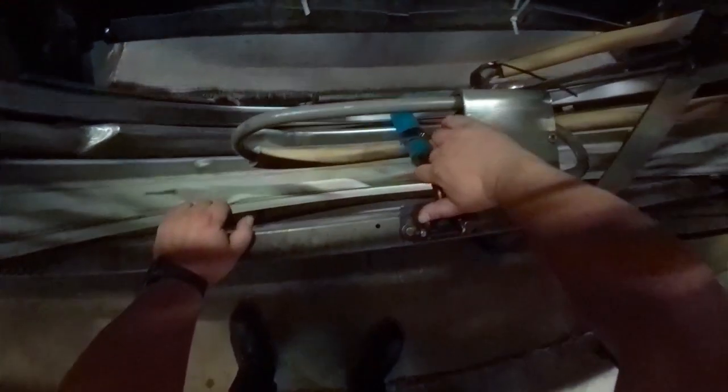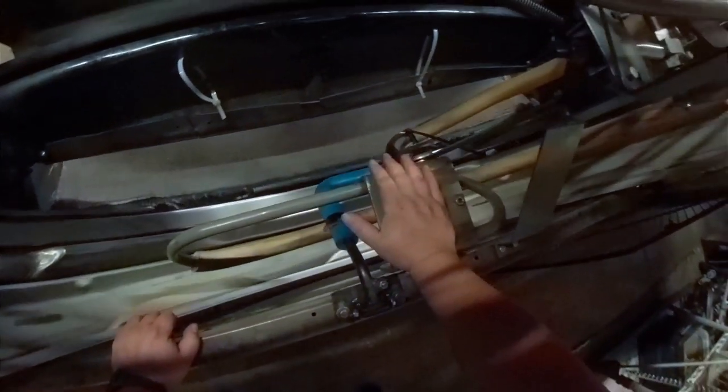I posted a video on it where we saw how this was affecting balls, how the clapper was not at the right adjustment for balls, and I saw the pressure today up here was not right. Now the problem is if you let this out and try to put more pressure to force balls through, you're putting all that pressure at this top part of the pivot point on the ball wheel guide roller. Eventually there's going to be so much pressure between the ball and the ball wheel, it's going to push out the guide roller. Your guide roller is going to come loose, and then you're going to have a floating ball wheel. And with a floating ball wheel, you got a whole bunch of ball calls, and you're going to sit there and put kickers and everything else on here trying to make it go, but you just got to tighten that down.